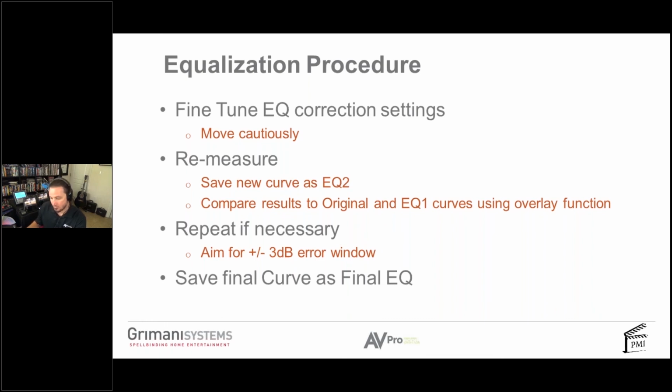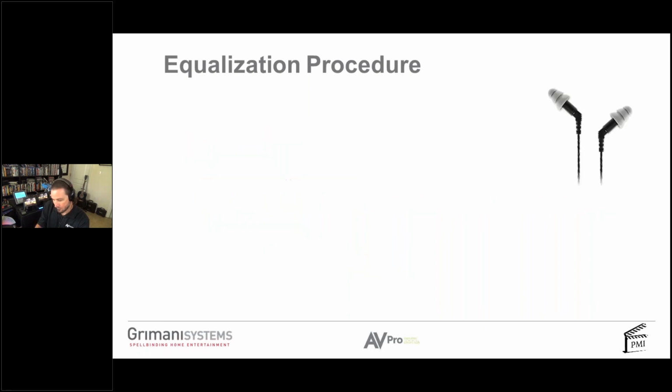I'm going to go back though to my preferred one, which is in REW. I had shown you that earlier. There is a way to ask it, hey, REW, tell me what bands of EQ you think I should do. If you're interfaced to one of the equalizers it has in its database, it can push that directly to the EQ, just like in video, where you do the measurement and say, okay, here's my data, shove it in, and it'll correct automatically or semi-automatically. And then you can do manual adjustments if you want.